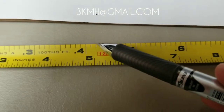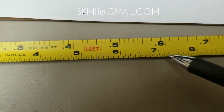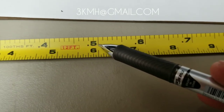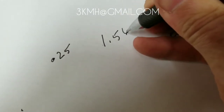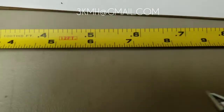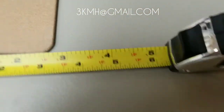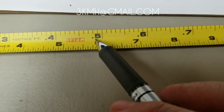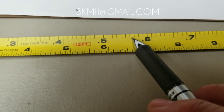Where the difference is, is that we use hundredths. There are a hundred hundredths in one foot. So let's say you saw something written down as 1.56 — find it on the tape. Let's say the one foot mark is over here. So you go 1, then 50, then count 1, 2, 3, 4, 5, 6 hundredths.